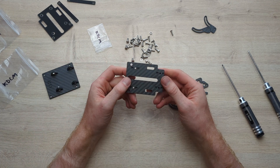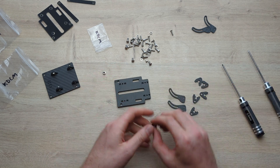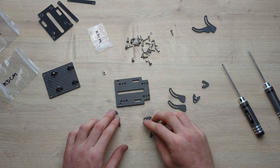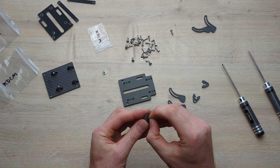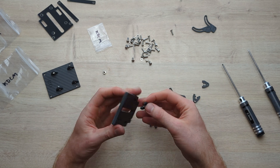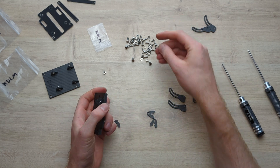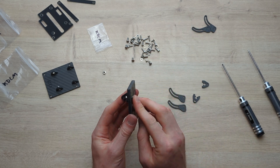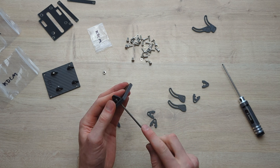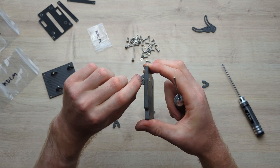We'll put that aside and come onto the top plate. You can see the same grooves on there — it's exactly the same as the bottom but the other way around, with the two small holes at the front and two with big holes at the back. It's the exact same process. Putting these M3 nuts in can be a bit fiddly, but once you get them in it's all right. This time we're going to use M3 by 12 screws because this is 6mm carbon.